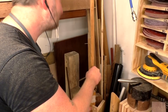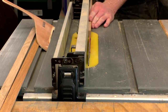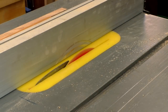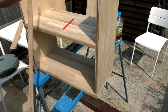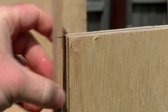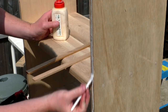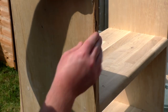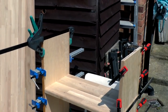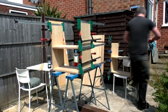I then went hunting for some pieces of oak that I could use to trim the plywood edges of the side panels. I ripped the oak into 5mm thick strips, then ripped them to 18mm wide which is the thickness of the plywood. I offered them up and marked them for length, then cut them at the mitre saw, and then I could glue and clamp them in place. Eventually I ran out of clamps while clamping up the second one, so I moved the clamps from the first one over to the second one after the glue had had a bit of time to set.